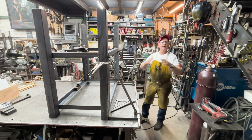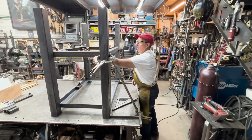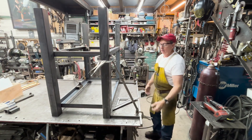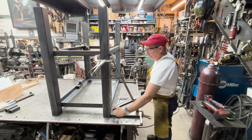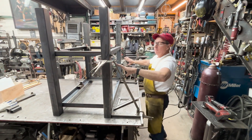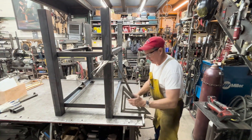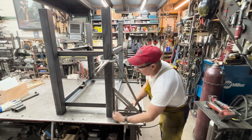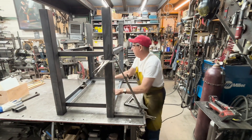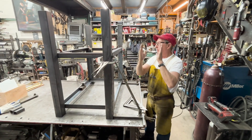So we're at the point of essentially three-dimensional fabrication. We've made our two sides. We've cut out our spreader elements exactly the same length. I've blocked off the table about 12 inches so I can get these little telescoping kind of guides to allow us to square up — to make this perpendicular so that we have a 90 degree relationship here and here. If we cut the spreader elements the same length we can be pretty much guaranteed that we're going to be perpendicular.